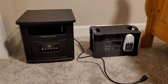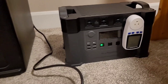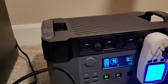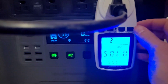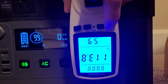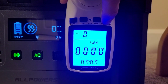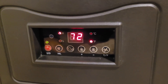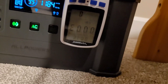I've got things set up in the basement spare bedroom — definitely one of the coldest rooms in the house. For this test I'm plugging in a small space heater to the S2000 with an Amazon power meter so we can see the full capacity. It's rated for 1500 watt hours but we'll lose some to efficiency losses. The power meter is reset and showing zero kilowatt hours, 114 volts, and 59 hertz. I'm going to fire up the heater on the high setting — should be close to 1400 watts and give us around one hour of runtime. There we go.